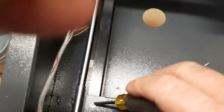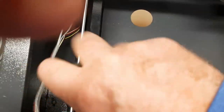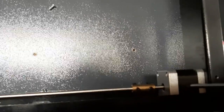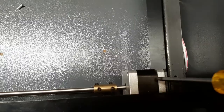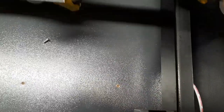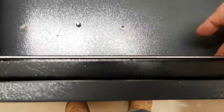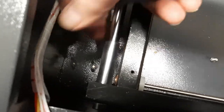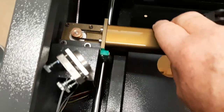You'll have a screw on each side. This is not the kind of video I would like to have made, but I'm getting ready to close my system up entirely, so it's either tear this out and show you what's what today or forget it. Underneath here what you have is a motor. This motor is double-ended, which means that the shaft comes out of both sides. On one end it drives the pulley which drives a belt underneath, which is what drives the right end of the X-rail. The shaft here goes across through and drives the pulley and belt on the left side, which again is what drives the X-rail.